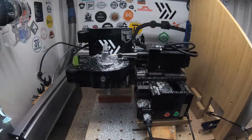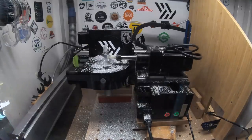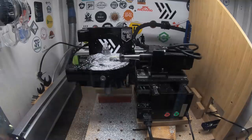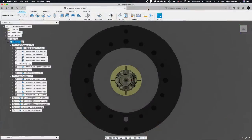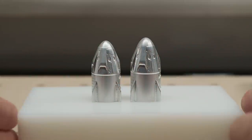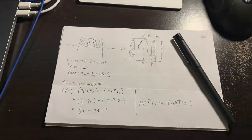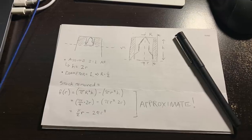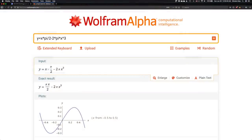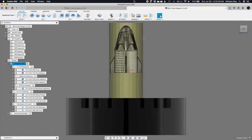So how do we improve things? The first thing I could do to speed up my process had nothing to do with toolpath optimization directly — it has to do with total material removal. If I increase the size of the dragon capsule, that reduces the material margin around it. The height increases linearly with stock volume consumed, but as the radius grows, the cross-sectional area to machine away decreases as a function of radius squared. With one-inch diameter round stock, as long as the trunk of my dragon capsule is greater than 0.6 inches, I'm coming out ahead by making it larger. Bigger dragon equals less material to remove.